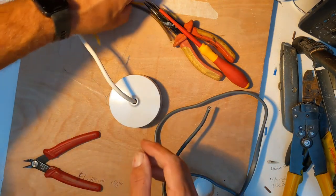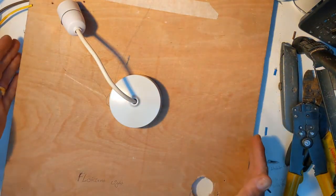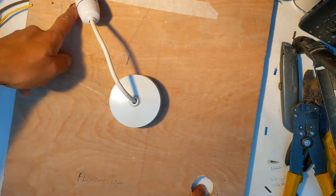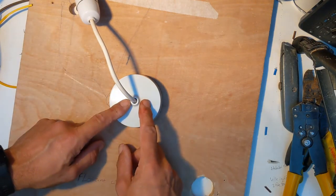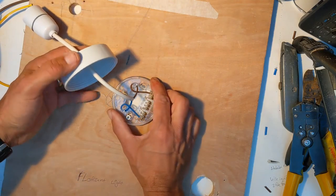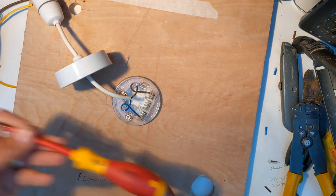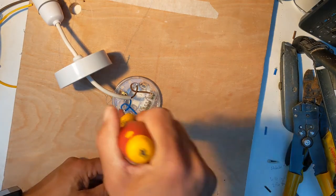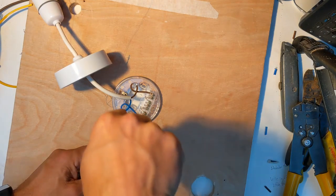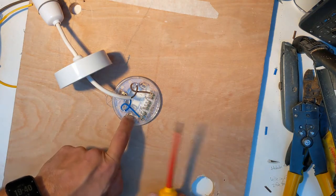This is the first of the tasks you're going to use the project board for. Here's your project board — it's got three holes drilled in it, we use it for plumbing and electrical. The two holes here are for your switches and the hole in the center is where your light fitting is going to be screwed. I've already fixed my light fitting in there securely. Don't use a drill driver to screw it in — you will crack the plastic — so drill a pilot hole or use a bradawl, then tighten by hand.